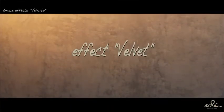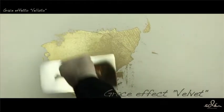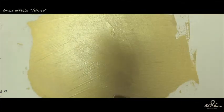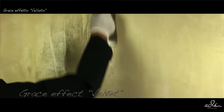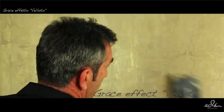Velvet Effect: When the product is in the process of drying and still wet, apply with a steel trowel a small quantity of product in an irregular manner, smoothing with an exhausted tool in alternate vertical strips. Repeat the same operation working horizontally and smooth perfectly to obtain the contrast of color and texture.